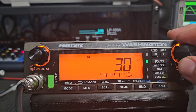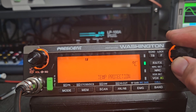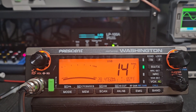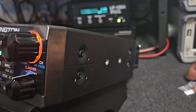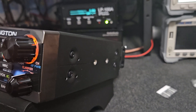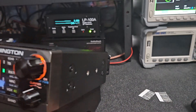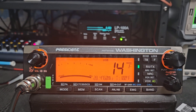I'm going to put the fans back to 50 for you. I'll let you decide where you want to run them — somewhere around 40 is probably going to make the fans kick on around 110 degrees Fahrenheit or so. You can play with it based on your operating preference. You've got the temperature readout there so you can figure out what's best. Hopefully you enjoy the radio. I'll put the sticker on the side since they give them to me — you get a spare set too. I hope you enjoy it and I will get this heading your way today. 73.